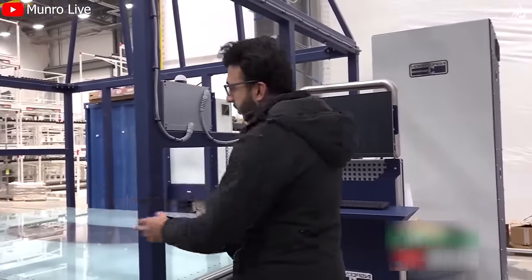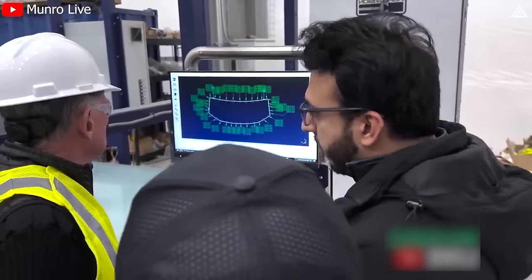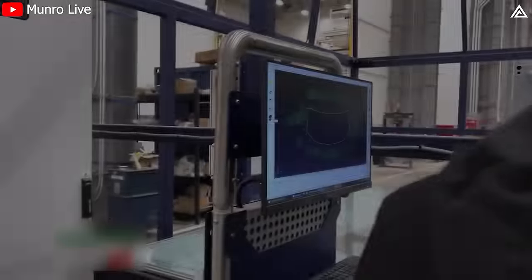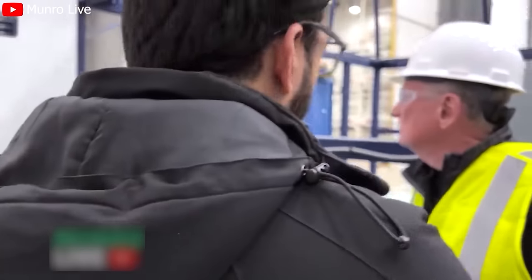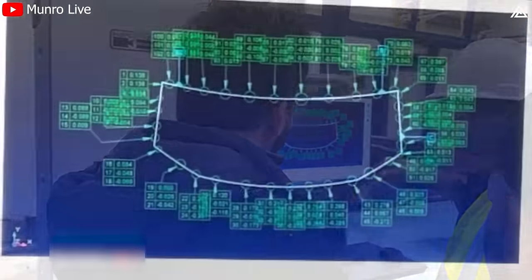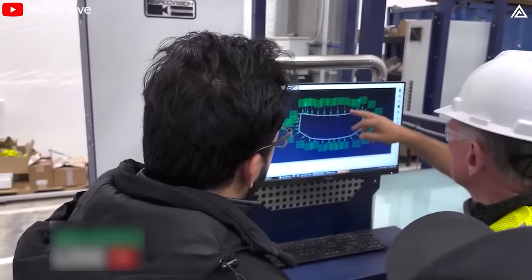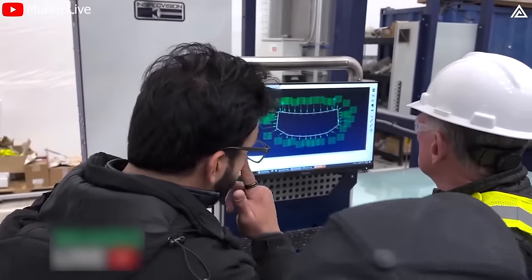This 2D scanning tool serves as a pivotal instrument for the team to uphold stringent quality standards throughout the production process. The precision levels achieved are remarkably intense, with tolerances as tight as 7 to 26 microns, as Elon has been pushing the team on. Moving forward, a glimpse of one of the dies employed to stamp the inner panels for the front doors reveals each door consists of a flat stainless steel outer panel and an inner panel providing structural support.